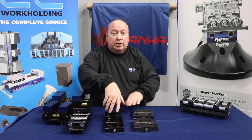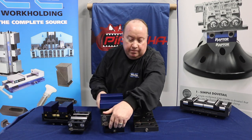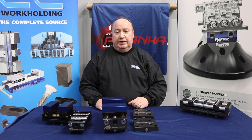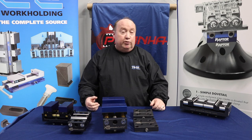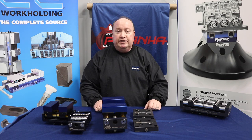These plates can also be ganged length or width, and they also fit larger vises. The jaw openings range from 0.196 inches on the smallest all the way out to 9.3 inches for the largest opening, showing you the variety of part sizes you can clamp in these vises.